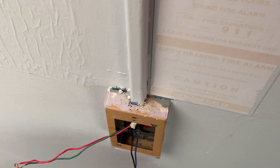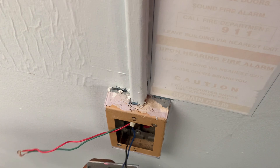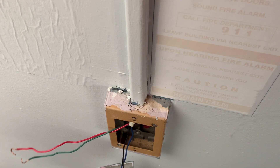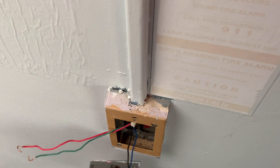This is a conventional four-wire fire alarm system — two wires for your power from the fire alarm system and two wires for your end-of-line. So there are four terminal screws. I've already undone two of the screws for two of the wires, and now I'm undoing the other two.